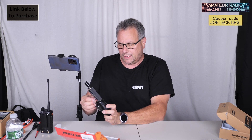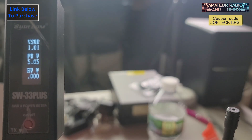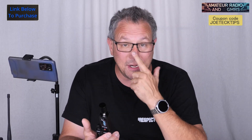Let's do 148 flat, which is the top end of VHF. It's receiving my repeater. Let's press it. The top end of VHF — 5.06 watts at 148 MHz. Puts out 5 watts! This thing is insane! The UV-5R Mini — holy crap! I was not expecting that at all.